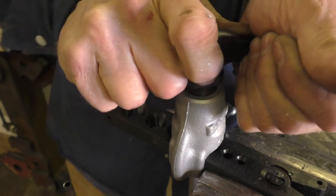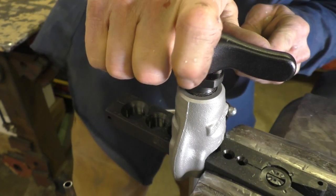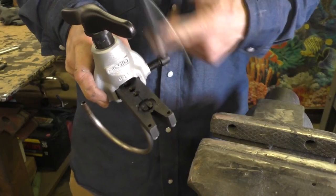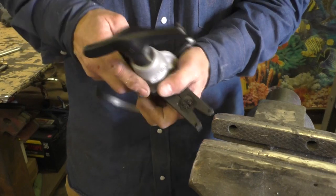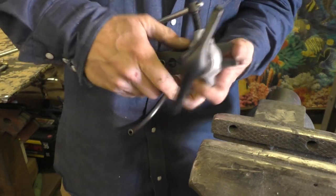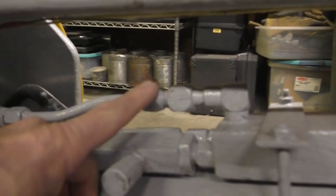You can also take a screwdriver or pocket knife, lift that pin up a little bit, and that clears the clutch to move a little further. Other than that clutch pin possibly not releasing, the only thing I can say bad about it is it takes longer to unwind from the tool. But if you're not going to be making hundreds of these, it's fine — that is a nice flare.